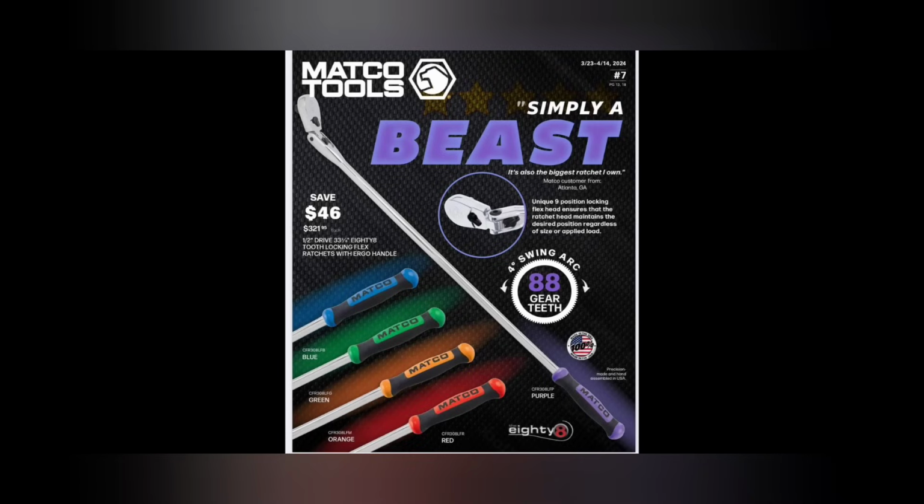I will say this is not my favorite ratchet for a 1/2 inch because it is like a rubber band. The shaft in this is not that thick, and there gets a lot of flex. Inherently, the biggest problem with a ratchet is you can make it longer, but if it flexes, you're going to lose energy, and that's just physics, okay? I hope that some of you understand that. If you've got a stiffer bar, let's say a pry bar like a 7/8 or a 3/4, the longer one gets, the thicker one is not going to bend as much.